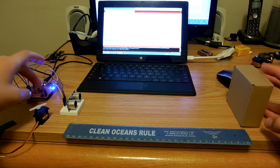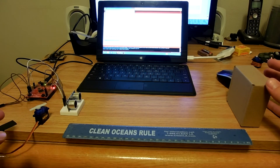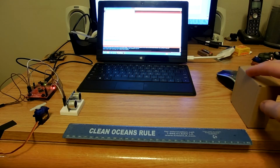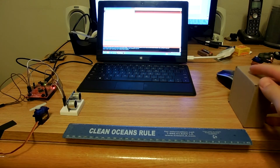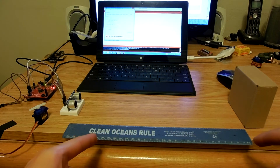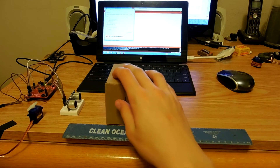I will start by pressing the second push button on the launchpad, which will disable smoothing. The red LED is on because I am using the red LED channel for the servo. This cardboard box is used to reflect the rangefinder's sonar pulse, and I am mapping the distance of the box between 2 inches and 12 inches to 0 to 180 degrees on the servo horn. As I move this box back and forth in front of the rangefinder, you can see the servo horn adjusting angle.